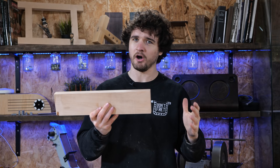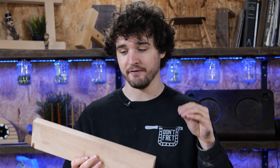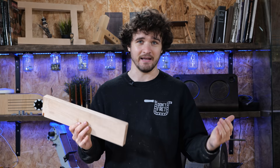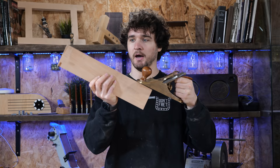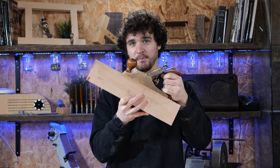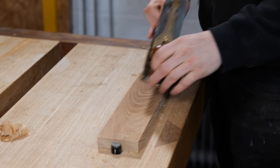Transferring pressure like this is often sold as a way to prevent putting arcs in an edge you're planing, but a plane does that regardless of whether you get the pressure right or not. For me, transferring pressure is more about energy preservation. If you're putting full force through the entire cut, it's going to start teetering when you enter. And when you're in the cut, pushing too much on the front creates a lot of unnecessary downforce and drag. Once the blade is engaged, the optimal push direction is perpendicular to the handle — about 30 degrees to the surface — not straight down.